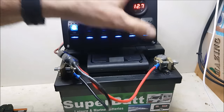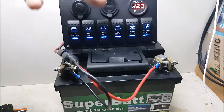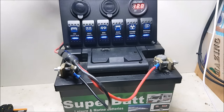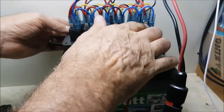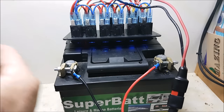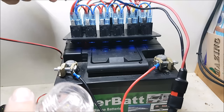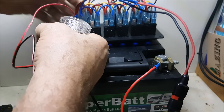These are just sort of 'here I am' lights - you can see me. These little lights don't actually do anything, they just sit there showing you where the switch panel is. If you want one of the main lights to work, on the back of the panel you've only got one connector left which is your switch connector - which is the live - or you can go negative if you want, but it's live. I'll demonstrate that - this is going on my boat. I've put a spade end on it, which will be lengthened wherever I want it on the boat.